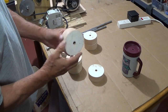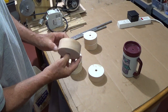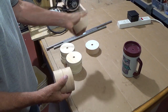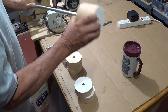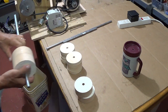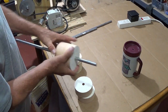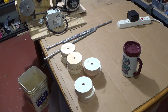Now that I've shown you how we made these wooden wheels — this is just pine, a softwood, not even a hardwood; you could try hardwood — I made these out of some two-by-sixes so they're an inch and a half thick. I'm going to combine them together, glue them onto my shaft, and then we'll set up the pinch rollers. I'm going to first start by just doing wood by itself to see if that'll hull rice, because the hardness of it is pretty hard. Later I'm going to coat these with some polyurethane 90 durometer.